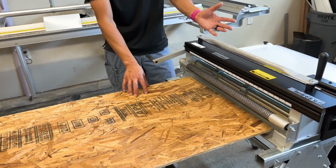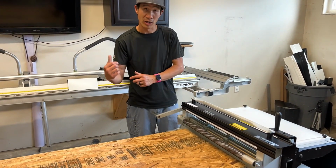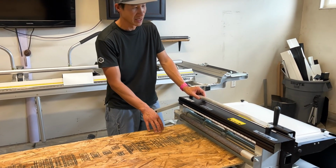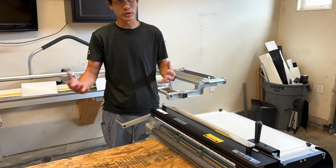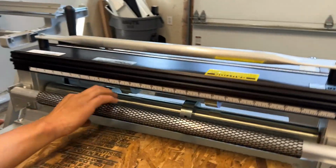This increases efficiency since you don't have to use a slitter on the brick. It splits it into however many sections you want based on the measurements here, and then using the cut-off tool you can cut it off. So I'll show you how to set up the Port-o-Slitter on its stand. Keep watching. How do you adjust the cutters?